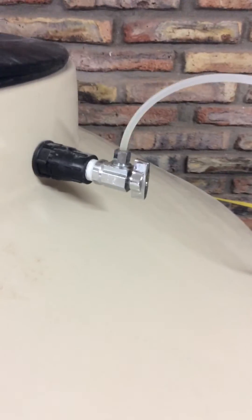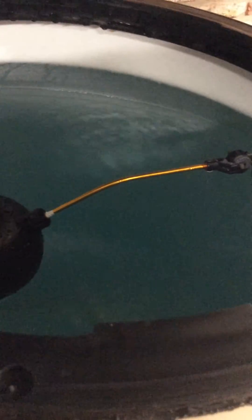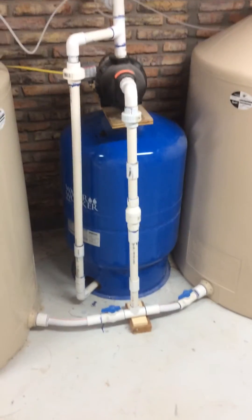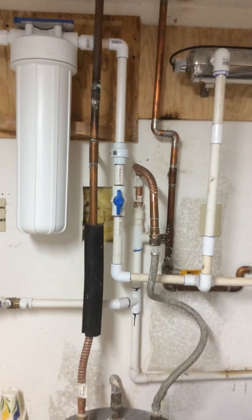The other side goes to my tanks, through a freshwater shutoff valve running at about 10 to 15 PSI, and into the tank where a little float valve shuts off the water once it gets high enough. You can see how clean the water is — it's testing out at about 60 TDS. Both tanks are being filled simultaneously, and I go into a bladder system and jet pump that feeds into my house.